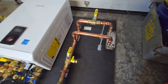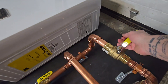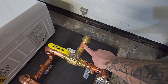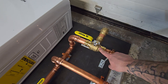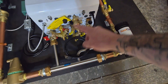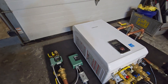To walk through how it works: when the customer wants to use the gas boiler, this valve will be in this position. I've got labels here marked wood or gas. The cool return water from the radiators comes in here, gets directed this way since the three-way valve is pointed that way, and directs the water down through the magnetic filter, through the primary loop, up into the boiler to be heated, through the air separator, and up to the pump which pushes it toward the supply to the radiators.